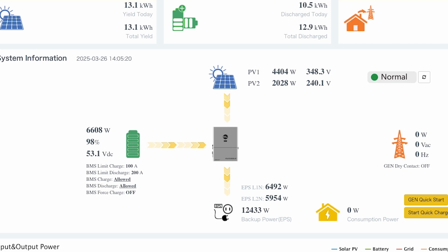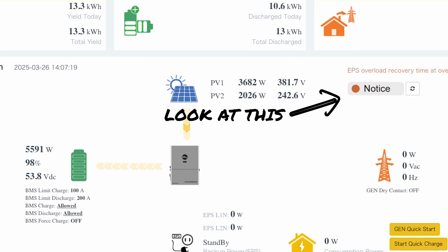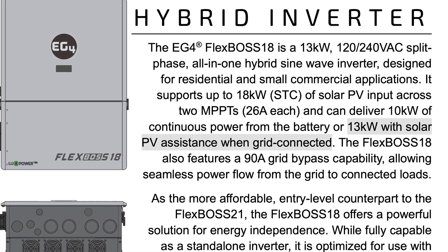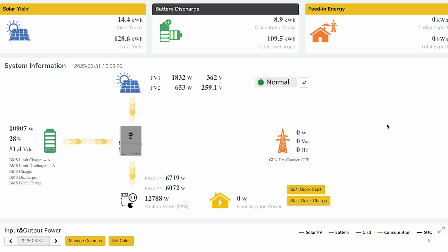A quick update on the Flex Boss 18. I was trying to do load testing to see if I could get 13 kilowatts out of it, but I wasn't able to get there. The verbiage in the specs and on the web page is a little misleading because it doesn't say everything — but then when you go to the spec sheet, it says it needs grid assistance. It just needs grid on there so if there's some kind of surge, it can be ready to help.